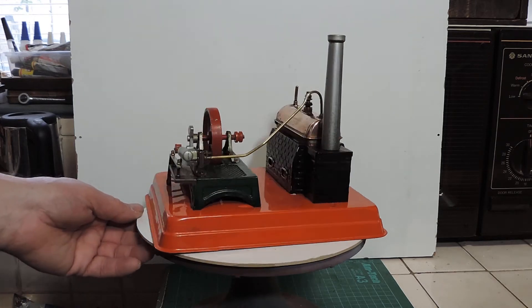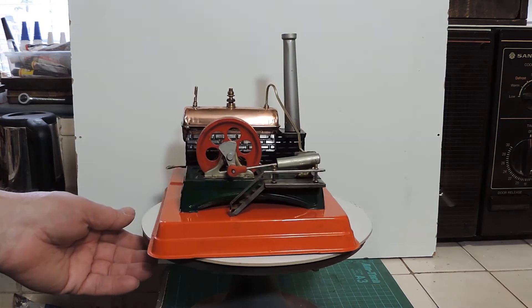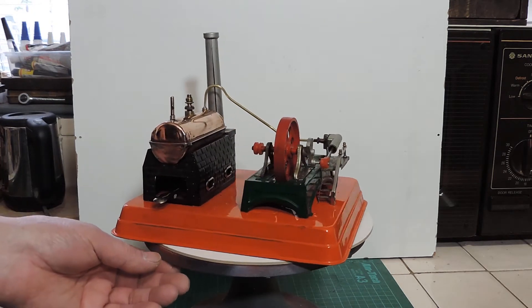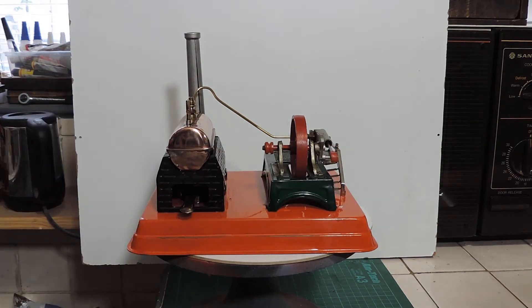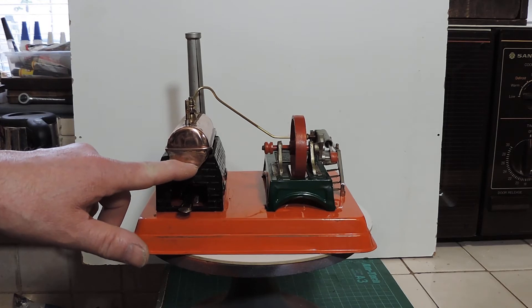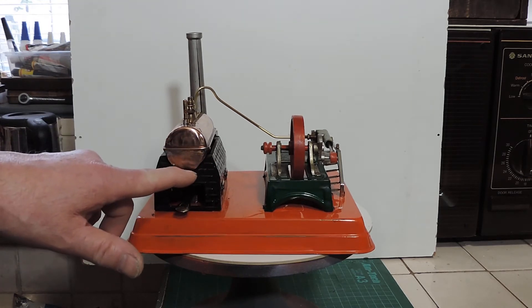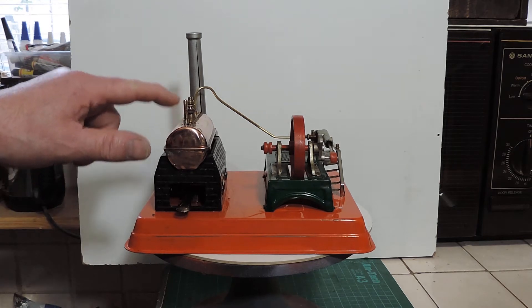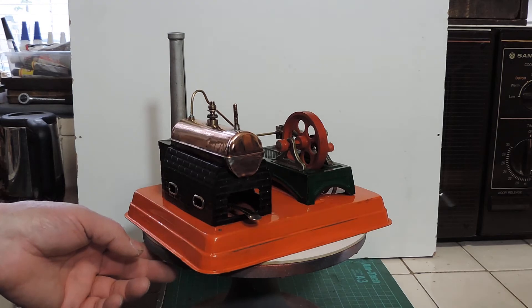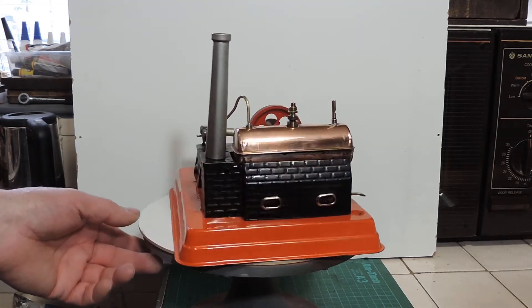Here's the Linemar engine — I've cleaned it up and it's come up very nice indeed. There are a couple of problems with the boiler once I got into it. There was a hole on the curve of the bottom part of the boiler, quite a large one, so that patch of copper you can see there. This dummy whistle here needed to be resoldered with the boiler, which has been done. I put water in the boiler — it doesn't leak, so hopefully we're good to go.